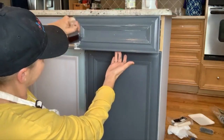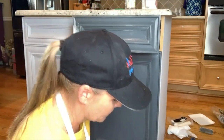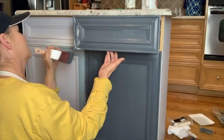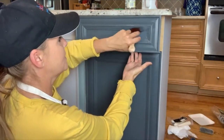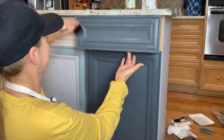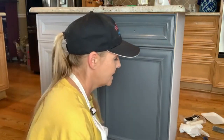Get down into all these edges and all that detail, then smooth it out with nice long strokes — don't forget to smooth it out. I'm putting very little paint on my brush. If you look at it and see some brush strokes, don't worry — go back with a quick mist of water and smooth them out. That is how easy it is to do your kitchen cabinets. I'll put my lid on this custom color — I will seriously have paint left over doing this whole island.